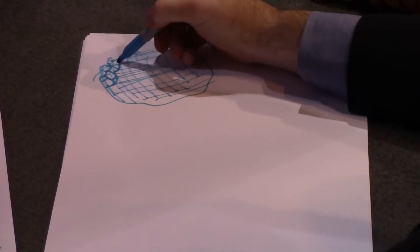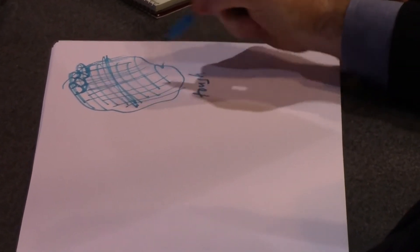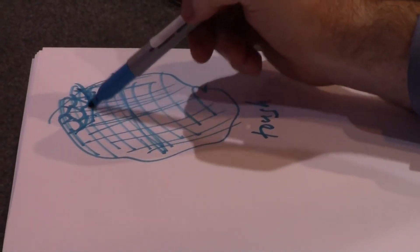I think I've got a handle on what's going on. The Norton SG grit has a fine microstructure — it doesn't have just a few big crystals; it's got billions and billions of little crystals. If you use them right, these little guys just kind of pluck out at the top so we maintain a sharp wheel. But because of the fine microstructure, the grit is really tough. You've got to hit it hard to get it to fracture. With ceramic grit, especially Norton SG, you've got to push it hard — you need a big chip load or grit penetration depth — or you're just going to dull it.